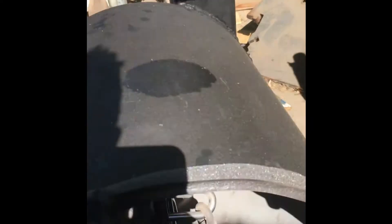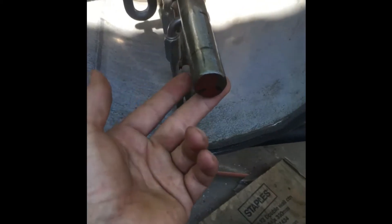I could have ground these all down to make it look seamless. Welding thicker material is much easier — this is 3/8 inch steel. It's basically a 16 inch outer diameter pipe, standard wall — not schedule 40, not schedule 20, just standard wall pipe. We put a foam seal around it to try and keep down the dust. It's only been tightened down once and you can clearly see it's already deformed the seal, so I'd probably get something rubber instead.